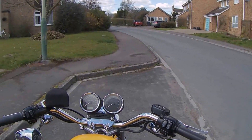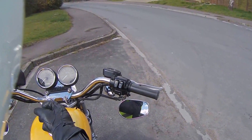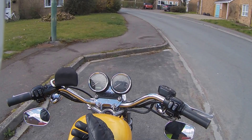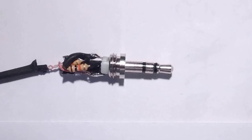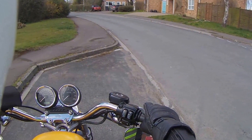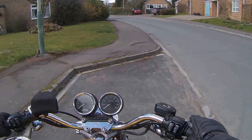This is test number five. I've got two 10K resistors in the microphone jack plug — I'll show on the channel how I fitted those. It gives about a 50% attenuation. I've got the microphone in the cheek pad just above my mouth with a foam sock on it and some fake fur around it, like a dead cat.